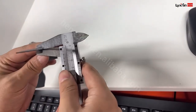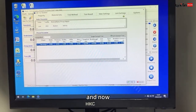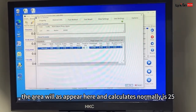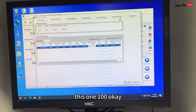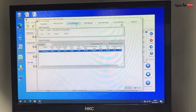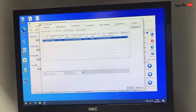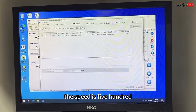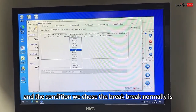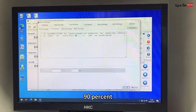Thickness — this went to 5. And now the error will disappear here. The gauge length is normally 35. This one, 100. Test method — pre-run, we don't need to focus. Tester: the direction is up, fixed. The speed is 500. And the condition, we chose the break. Break normally is 90%.